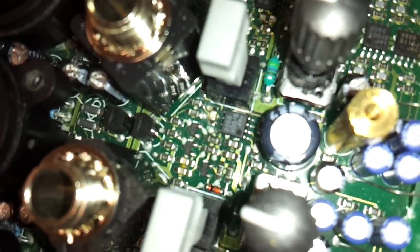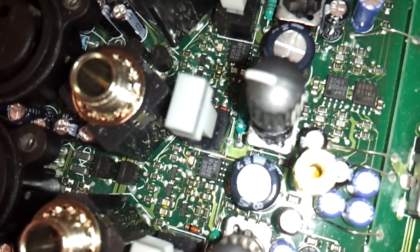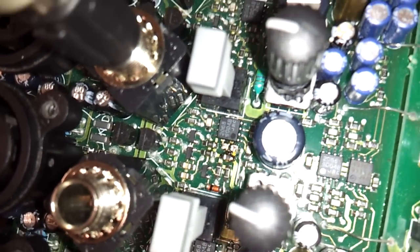There are two ceramic bypass capacitors in the op-amp circuit — the 2068 op-amp. But if you look at the next one over, you see how it's brown? I pulled that capacitor out — that's where the smoke was going. Another shorted multi-layer ceramic capacitor. There's the original cap I pulled out. I removed it and the rail voltage short just went away.